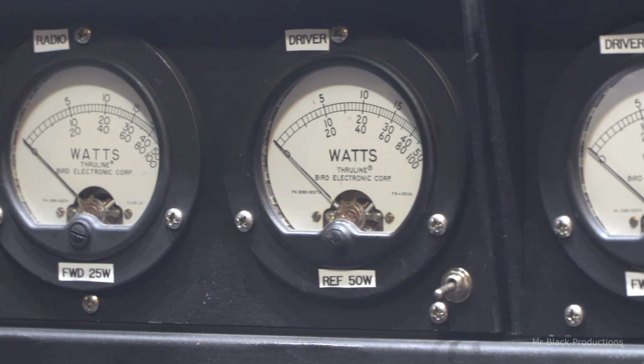Now, a lot of guys are going to run a hot and a ground. Like in my white truck, which is primarily car stereo, to help avoid having ground loop issues, that means different ground potentials between different amplification stages in a car audio or audio chain, or multiple points of isolated differentiation and ground, I ran a hot and a ground off of each alternator back to the battery, back to the source. But also I ran 3-inch wide ground braid from one end of the frame to the other, and then bonded everything about every 6 to 12 inches up and down the whole truck. Because remember, the more metal mass in a mobile you can put underneath the antenna that's flat at the same electrical potential, the larger reflective surface you get, which means, guess what? You're going to transmit better.